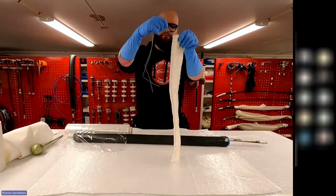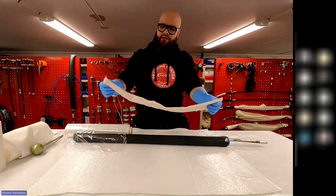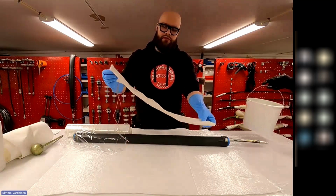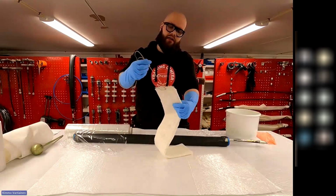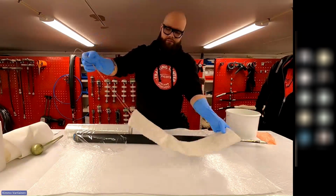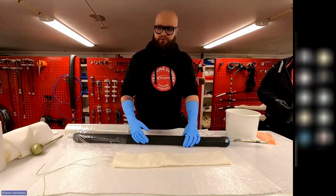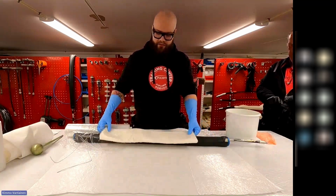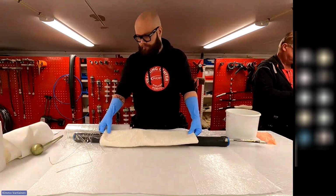Yeah, we have this piece of liner we are using now for this demonstration, and of course there's many ways to do this, but here, for demonstration purposes, we have a piece of Bravo liner, and then we have attached 2 paper strings to the front of the piece. And that's why, when we push it to the pipe, of course now we don't have any bends, we just show it in the transparent pipe, but these are going to hold the patch piece onto the packer so it doesn't come off so easily if you would have the bends.